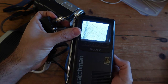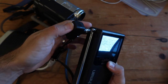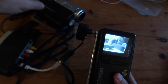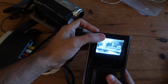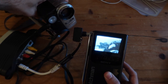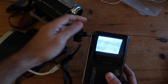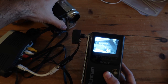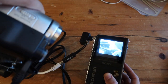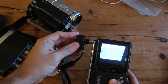I just turned on my camcorder, which is going to be used as my input signal. Plug your 3.5mm connector into the side of your Watchman and change the channel to channel 3, which is the channel set on my RF modulator. You'll get the input signal from your camcorder, and as you can see it works really well. It's a little glitchy because the connectors can move around, but make sure your connections are tight and secure and it should work fine.